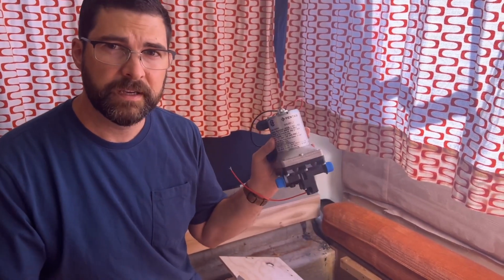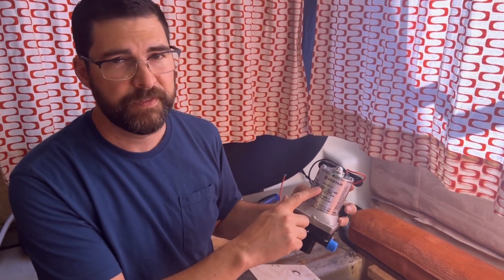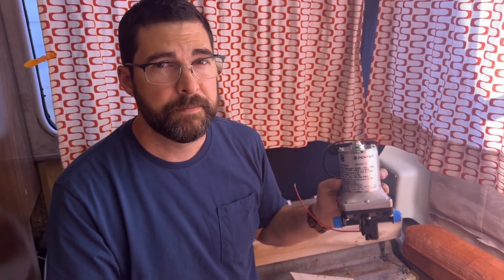The one that I got, and I'll put a link to it in the description of the video, I just got it on Amazon. It's a Pentair SureFlow, and the model number is a 4008. This one does 3 gallons per minute with a pressure of 55 psi. This is the model number that I saw quite a few people with GMC Motorhomes talking about, saying that's what they used and they liked it and it worked well. Looking at the pump that I have in there now, it's also a SureFlow, and it looks like it has a 2.8 gallon per minute pump rate. And so I think the 3 gallon may be a little bit of an improvement. We might see a little bit more flow from our faucets and things.